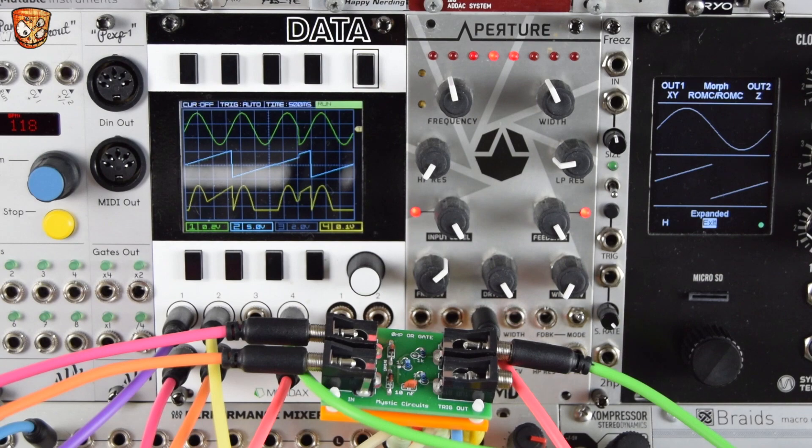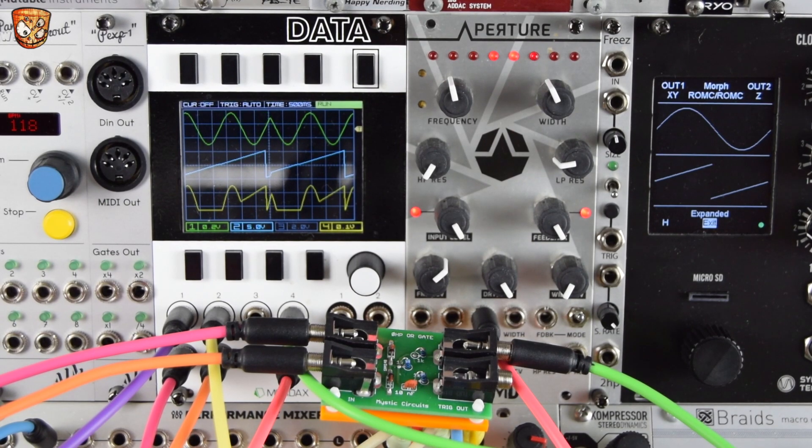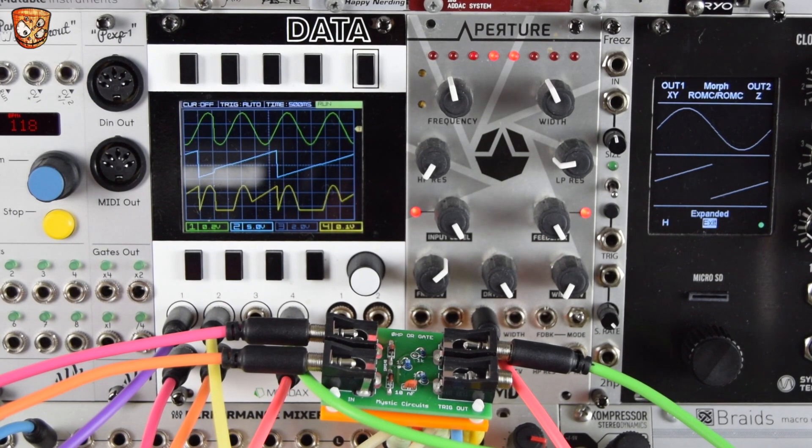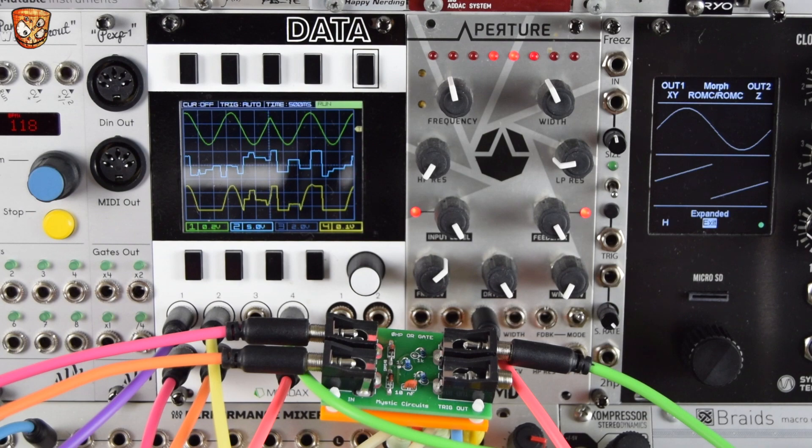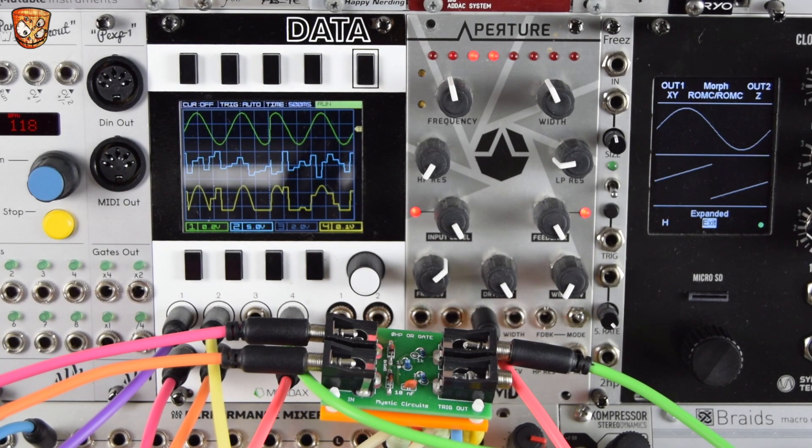With both inputs plugged back in, we get a more unique shape — always the maximum voltage between zero and five volts. Between the two inputs we still get some held periods where zero voltage is present on both ends, so we half-wave rectify and cut those out. Now let's change that ramp wave to a sample and hold — again a nice unique way of combining voltages.